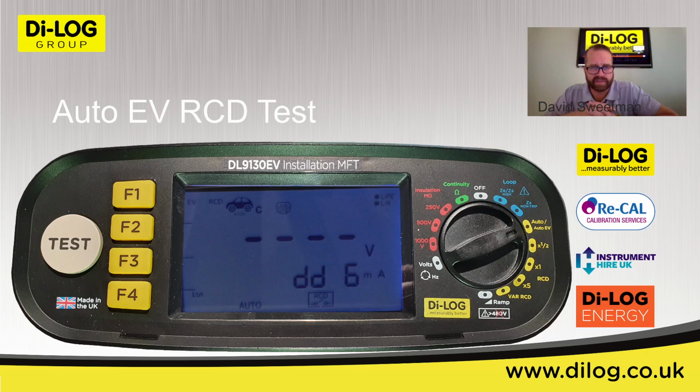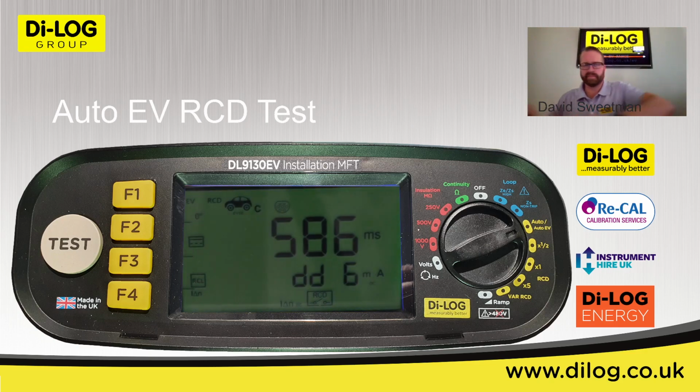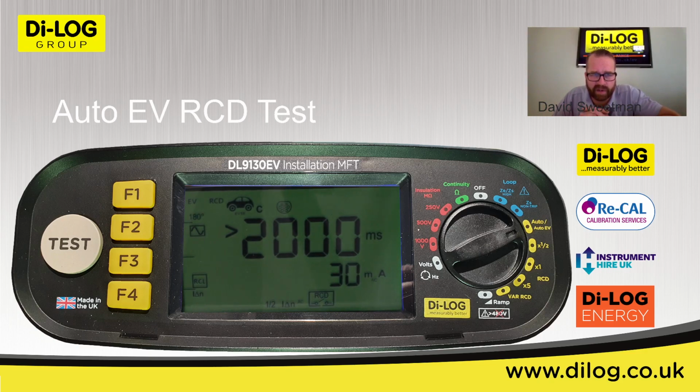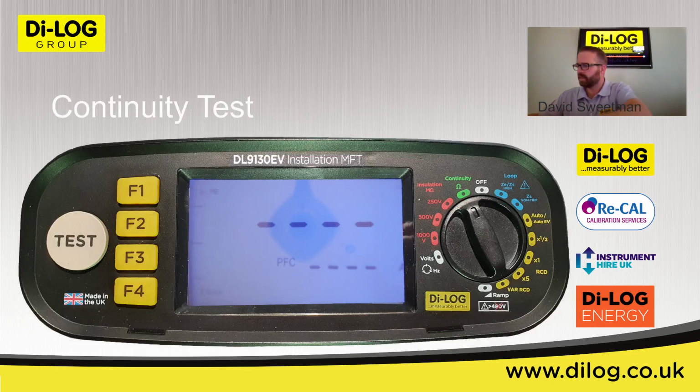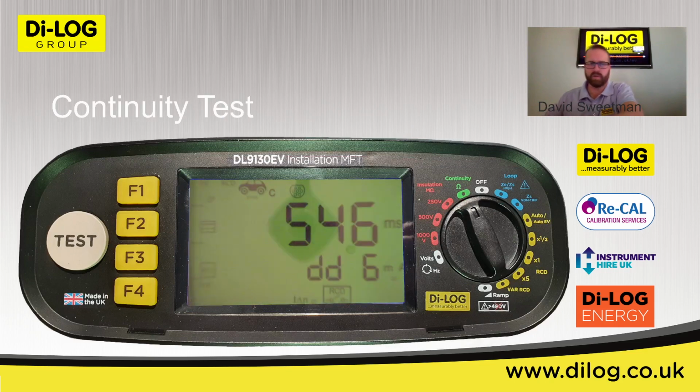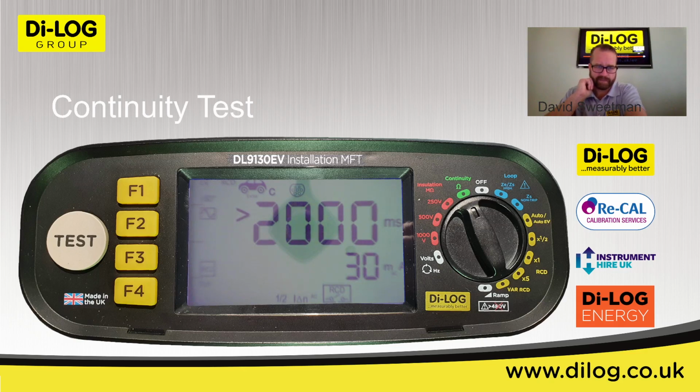So if I run that, should be able to run that again. There you go, so you've got 0 and 180 on the 6 milliamps, you've got half at 0, half at 180. You've got 0 at 1 times, 180 at 1 times, you've got 0 at 5 times, 180 as well. And what I can just do very, very quickly is just recall that on here as well. So there you go. So here you've got your results by pressing function 3. You can see all the recorded test results in there.